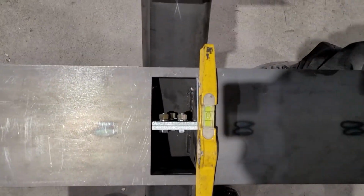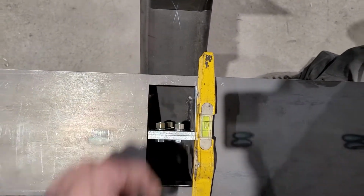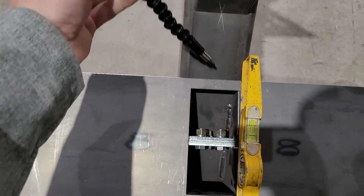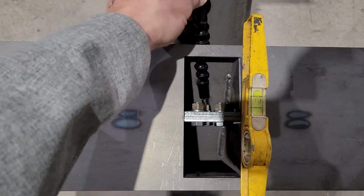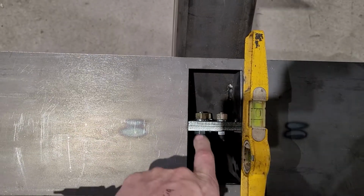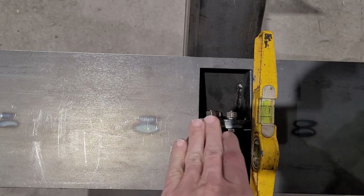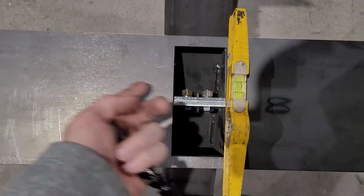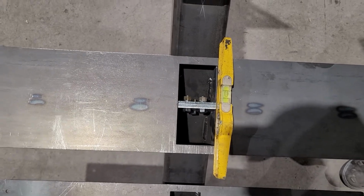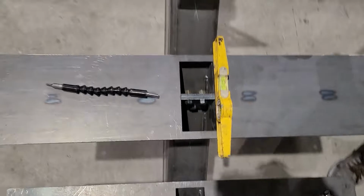Like I said, they're usually really close, but you can see it's just a hair off. So if you tighten that bottom set screw, and that's why we give you this nifty tool, this will slide down into that bottom one, and you can turn that. If you loosen your screws up just a little bit, you can tighten that bottom set screw. It will force that step over that direction. It's probably maybe a 1/16 of an inch or so out right now, which isn't much, but it gives you that option to do those adjustments on the fly.